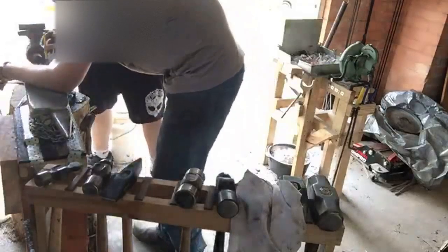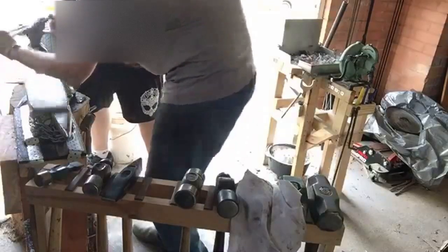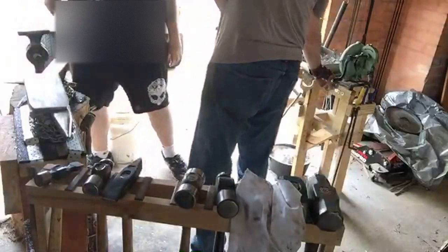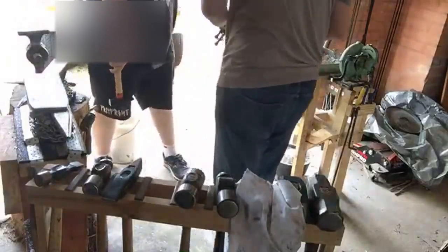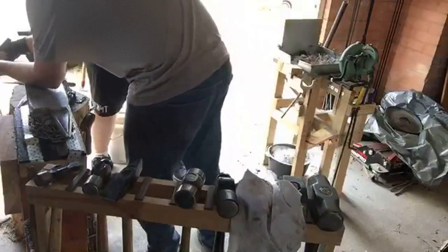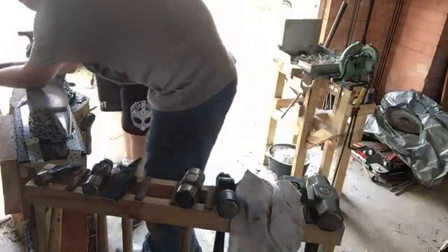So what we're probably going to do is punch this one, this, and this one with this, and I'll get the bigger chisel and you can punch the middle one. Beautiful. So it's decisive blows, but it's not like you're trying to thin out material or anything. This will cut through pretty easily. Try not to kill you. What you can do is we'll do it while it's still coldish, and do some light chisel work. You can test it out.